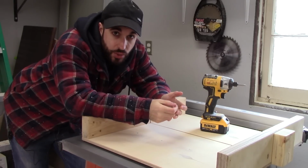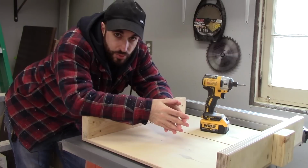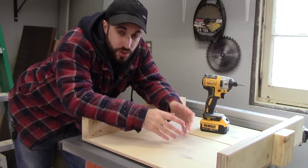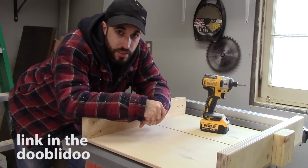That means that they're all 90 degrees to one another. The thing about a table saw, though, is that it's typically made for ripping wood to a certain width. It's not really made for cutting 90-degree angles. So in order to cut 90-degree angles, I use this homemade jig here. This is called a Crosscut Sled. There's more information about it in my table saw basics video. There's a link in the description if you haven't seen that one.